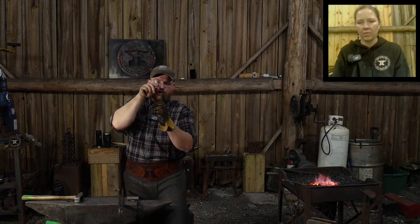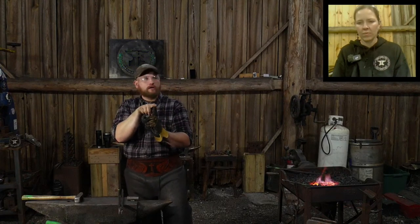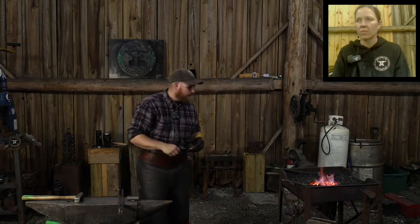They drew out a tongue and then folded it back on itself and re-welded it, right? They did that because it's not possible for you to punch and drift a hole on the end of a bar of wrought because of the grain, the wood grain-like structure, the fibrous grain. Also, when you're making an item from wrought iron, you always are thinking, just like in woodwork, how your grain is running, what direction and what flow that grain is running.